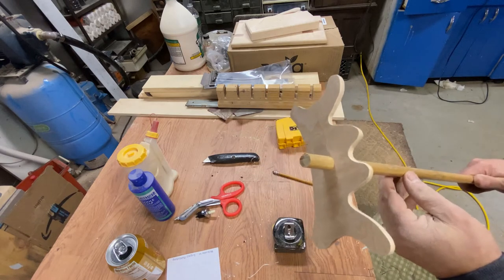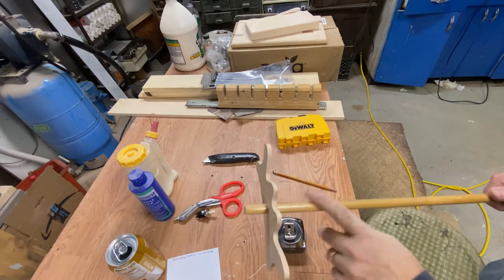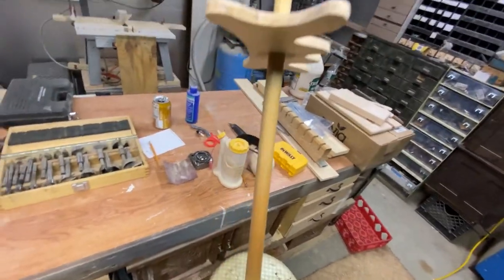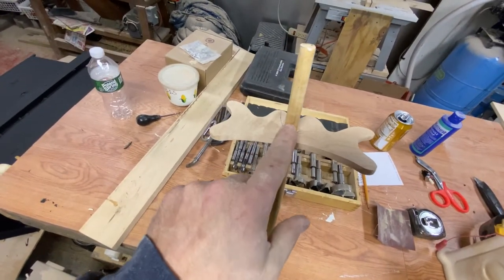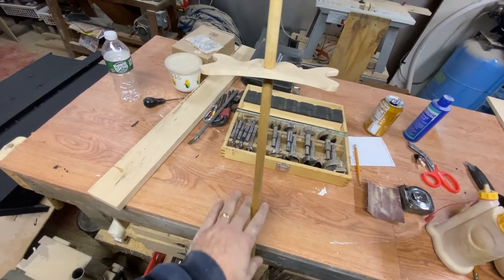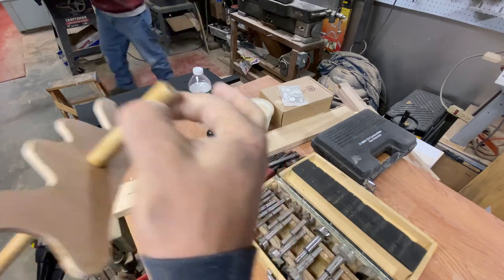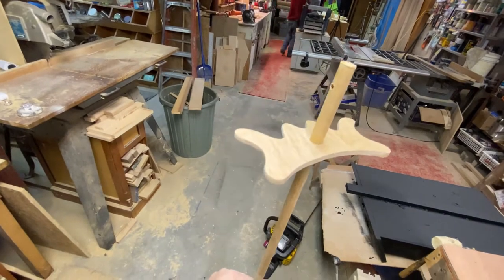I'm going to get it glued and then cut off the extra. Before I do that, I'm going to clean the finish off of this stick here so I make sure I get good adhesion from wood to wood without having this clear finish on it. I've got some glue on it, got it shoved down on there, and we're going to let that dry. Then we'll cut this off, sand everything up, and I might sand the handle down a little bit and put a new finish on it. I also drilled a hole in this so I can hook something to it and hang it while I spray it — and that end is going to get cut off anyway.